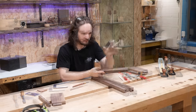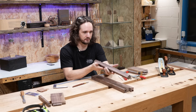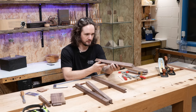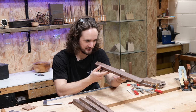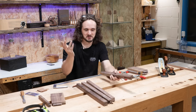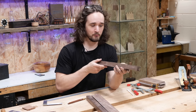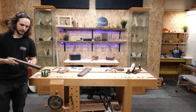I'm just doing a visual check that if I look at the show faces — the face side and the face edge — I can see both tapers, which proves I've done it on the correct faces. It's always worth double checking. You can taper the outsides of legs if you want — design is design — but for the most part this is how it was traditionally done with these kinds of tables.